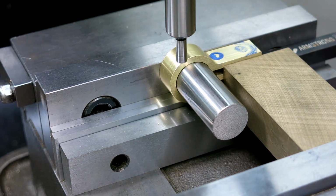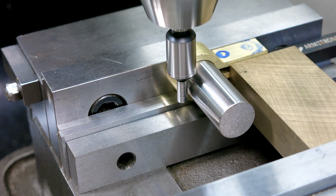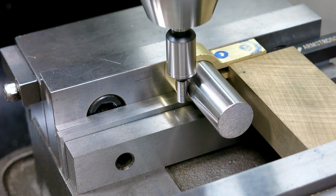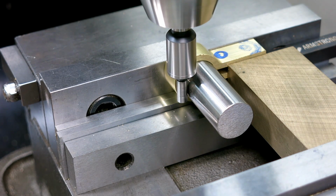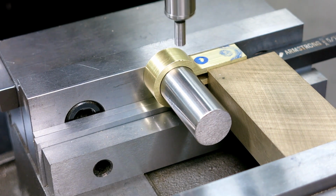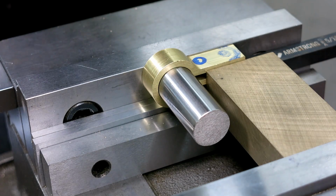Come all the way over here. I'm using the center line function of the DRO, which is pretty handy when you want to pick up the center or something pretty accurately. All right, and then whatever's there gives me the exact midpoint of that, which is, you know, for shafts and keyways and centers and stuff like that. It's kind of the hot tamale there.